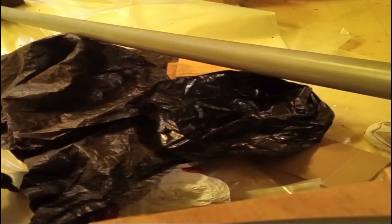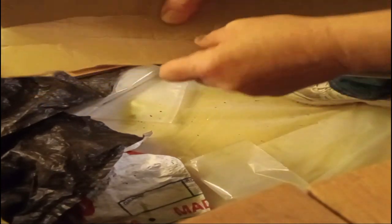Let's begin. First of all, we want to use whatever insulated materials are available. Don't worry if it's pouring rain - just get them and get them on there as fast as you can. Don't get panicked, don't get frustrated. What you can do with pieces of cardboard is wrap them in plastic if it's raining or there's a lot of snow. That way you already have your cardboard insulated - it won't get too wet. You'll be able to put it on with the plastic around it, but first you should soften it so it will go around your pipe.